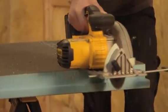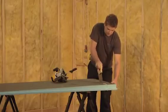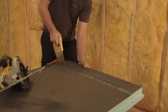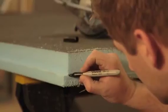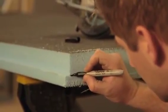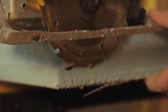It's important that the Z-notch channel is recreated using a circular saw. This channel will allow for a safe seal and connection between the Rialito base and the WEDI building panels on the wall, sealed together with WEDI joint sealant. It's a best practice to cut through the base's heavy-duty traffic cement coating using a circular saw.